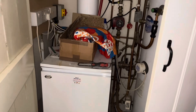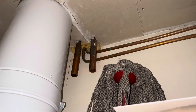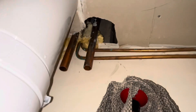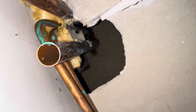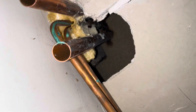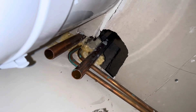This is the boiler room down on the ground floor, and up there is where those two copper pipes come through. I'm hoping there's going to be space to put a flexible pipe all the way down through there, so I'm going to cut out the ceiling a bit to check. I've cut out the ceiling now — looks like there is plenty of space up there, but then there's some chipboard I've got to cut through. I'm going to try cutting the other hole down through the wardrobe first to get experience cutting through chipboard. I also want to work out whether I want 90mm or 75mm pipes, so I'm going to do some research on that first.